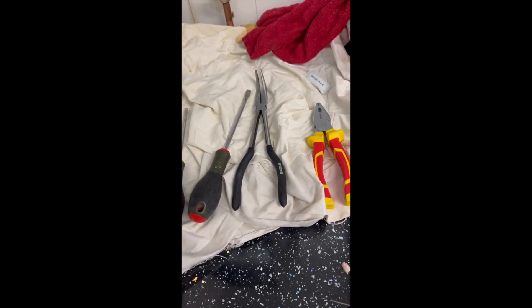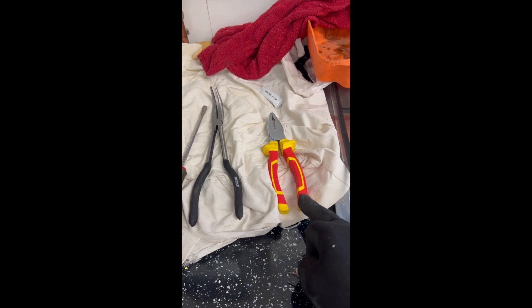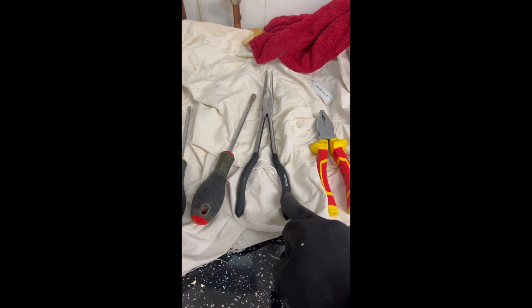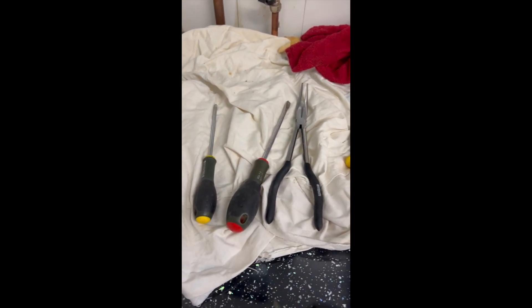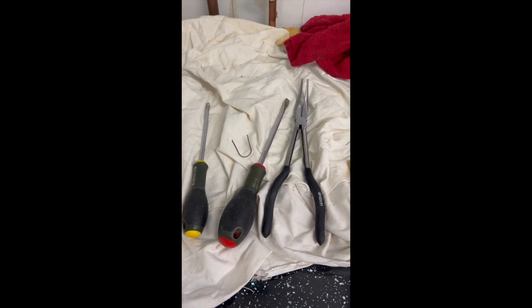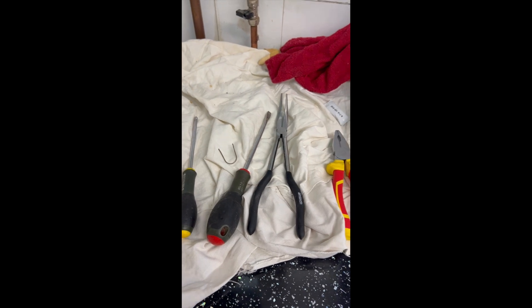Here are the tools I used: one to pull off the outlet from the PRV or safety valve, another to access the clip, 11-inch angled pliers for the flow and returns, and a tool simply to get the case off. I didn't use the clip that came with the new valve because it didn't appear to be as good a fit as the original. Job done.